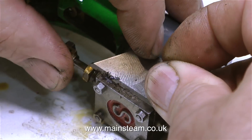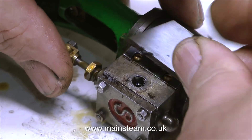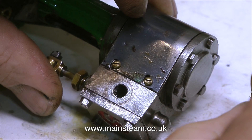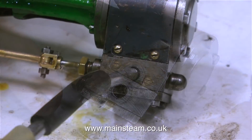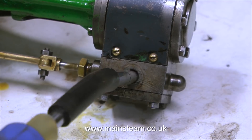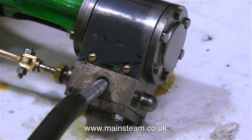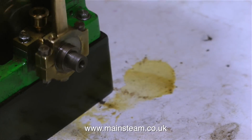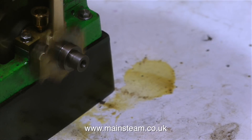In this clip I'm using a Stanley knife blade to clean off some sort of sealant that's been applied there in the past. Now I'm about to use the airline to blow away any traces of sealant that may have got into the steam chest. Then I put my finger over the hole in the other side of the steam chest where the displacement lubricator was and blasted some air into the engine just to make sure that it still runs well.